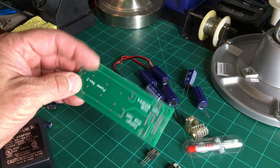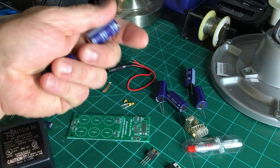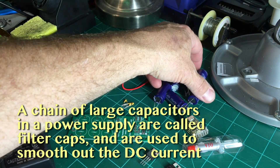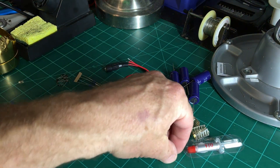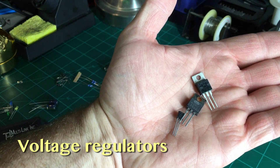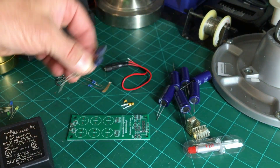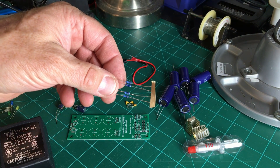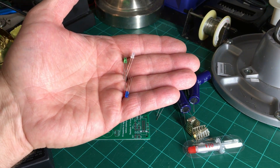The PCB is well built and very easy to get — it was made by Frequency Central in the UK, and I purchased it from synthcube.com. We've got these big power supply filter capacitors: 4,700 microfarad 25-volt electrolytic caps. We've got six of those, which smooth out the alternating current into nice, clean DC. These are the voltage regulators that give us plus 12, minus 12, and 5 volts — very simple, very inexpensive. We've also got a few small electrolytic capacitors, some 100 nanofarad bypass caps, four quarter-watt 1K resistors, six 1N4004 diodes, and confirmation LEDs to let you know each channel is functioning properly.